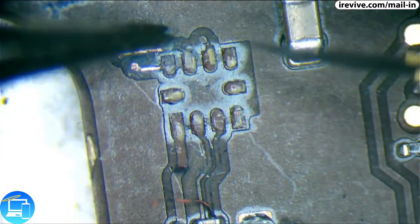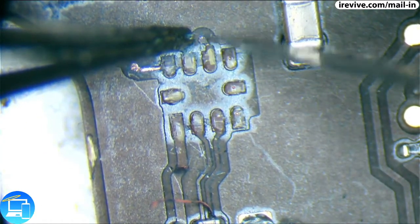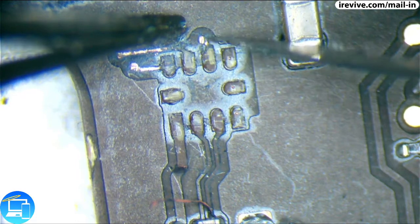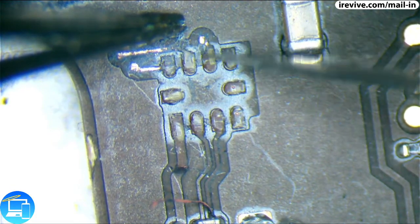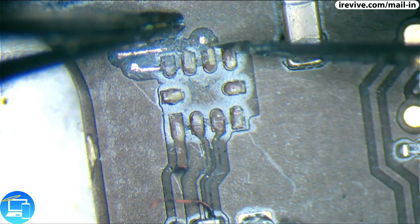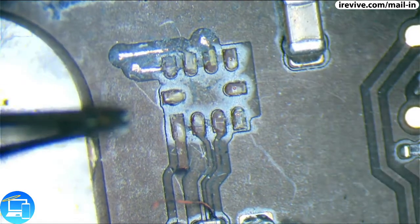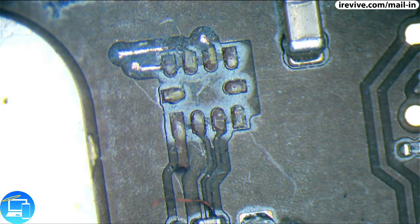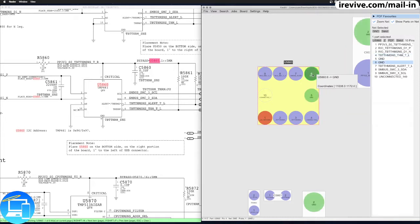Now let's move on to what I can assume is pin 7. Now, on this pin, pin 6 is actually going to be ground. So we can actually just steal ground from a nearby component. You can see right here, pin 6, it's ground. So in theory, we could actually just solder a wire from ground, let's say from like this capacitor, and that would work.